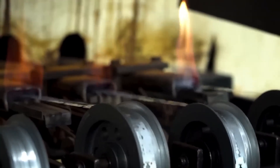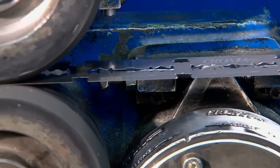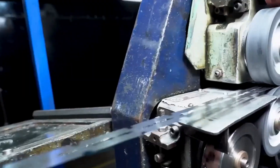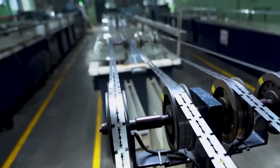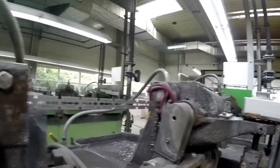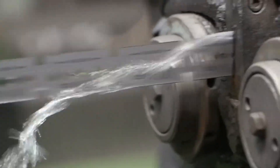The manufacturing process continues by taking the already hardened preforms to the printer. There, the logo or identification of the manufacturing company is stamped, and then the wet ink drying process is done with gas flames to ensure immediate drying. Then another phase begins with the help of the grinding machine to make the preforms definitively turn into blades. All of them are introduced into this machine, which has three grinding bases that sharpen the contour and create two extremely sharp cutting edges.